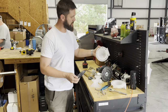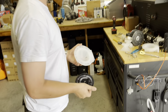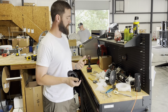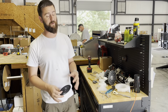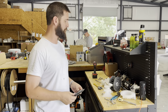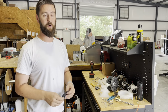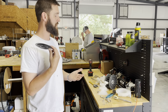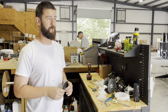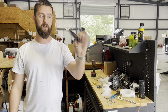There's really not a lot to these little pumps. Most of the innards are plastic, which is the benefit of an air diaphragm — there's really no metal to corrode. Nothing in here really ever sees metal. You do need a water separator and a good regulator if you're going to run an air diaphragm system. I personally don't recommend air diaphragm systems for a truck rig out soft washing in the field — not only do you have potential issues with the pump, but you've also got all the maintenance on a gas-powered air compressor. Nothing wrong with them if you've got one — you probably love it. Also don't like the spray pattern because it's kind of jerky.